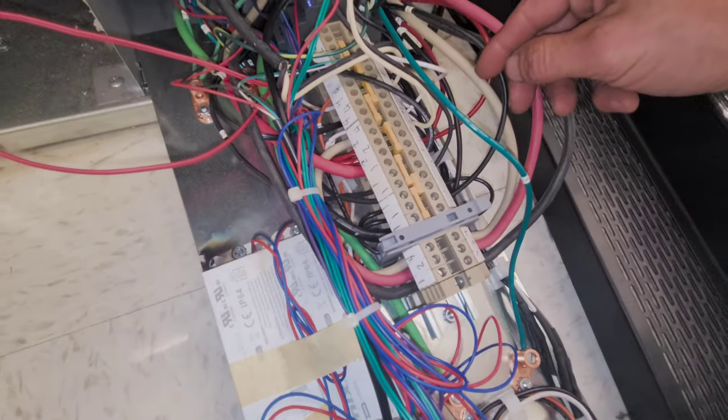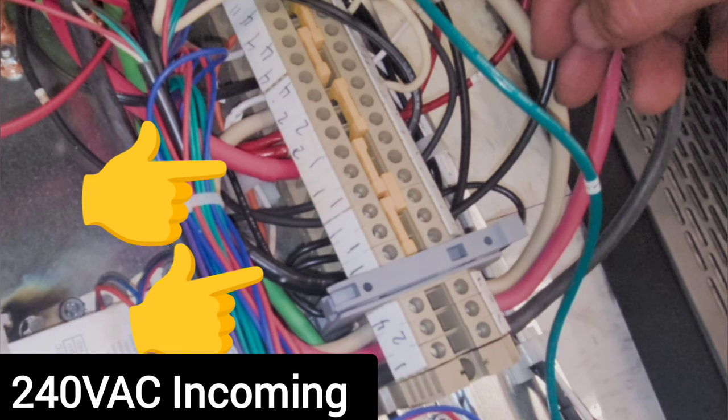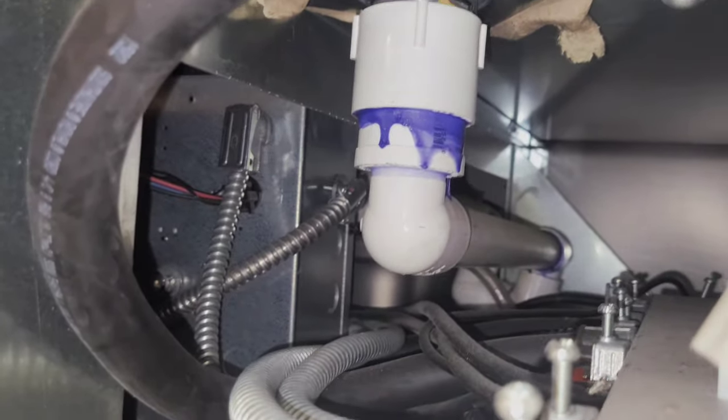If that would cause it, the whole unit would be down. I'm positive that I've got power going to my compressor. There are two compressors on this unit — both of them come into the same terminals here and they both get power simultaneously. Since the left compressor is running and the right is not, I still know my right compressor is getting power without even pulling out my meter. My compressor is cold because I touched it a little bit ago, so I need to get into that box to access the starting components of the compressor.